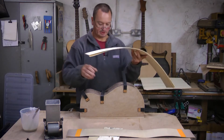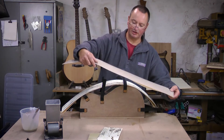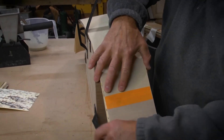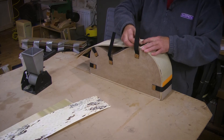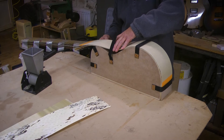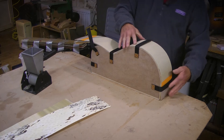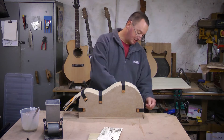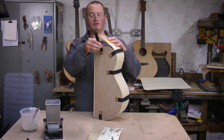I've got one of the moulds. It's important to make sure we put it the right way up - having the fancy veneer on the outside. Then what we've got here is what we refer to as a caul - just another thin sheet of plywood with a non-stick glass cloth material on it. We put that on top of the veneer, on top of the layer. These are like double-sided Velcro straps - they're really useful for holding the material more or less in the shape you're going to be pressing before you put it in the vacuum bag. Just make sure everything's positioned correctly, and if you're using very fancy book-matched veneers, you need to make sure the registration point on the mould matches up with the veneer. It's easier to do that before it goes in the bag than after.